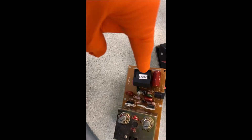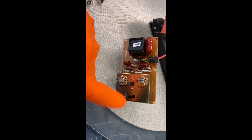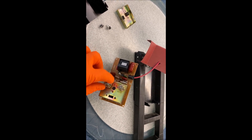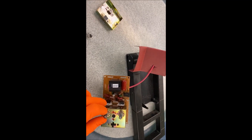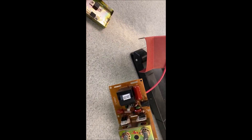So we dug a little bit deeper. We checked out this switch and it works. Then we went through this potentiometer here — now this ain't the kind of pot you can go out back and get arrested for — this is the kind of pot that will make this Borg disc really cool. We tested them and they tested real good too. Then we tested the TIP transistors on both sides and actually replaced them because we were getting some funky, not-quite-certain readings. We replaced them and were like, 'yeah, this is gonna work' — and we were wrong.